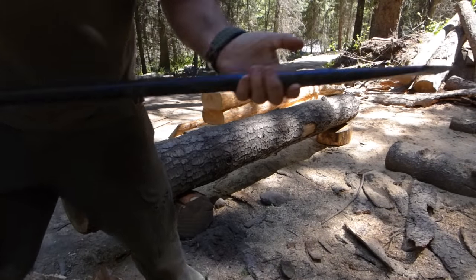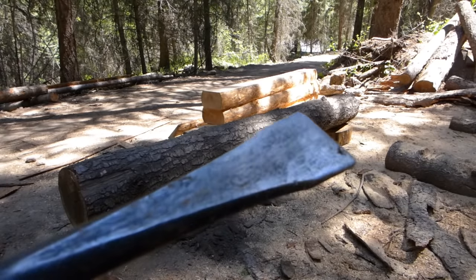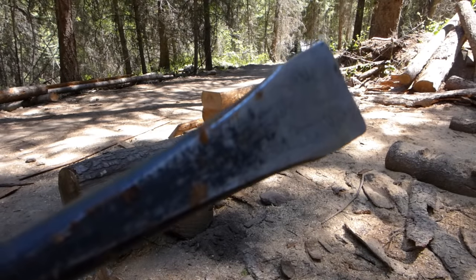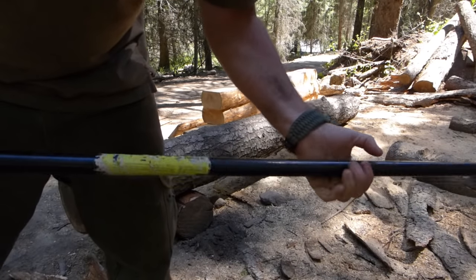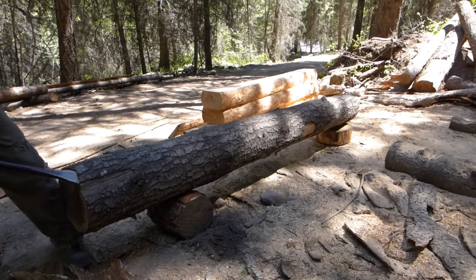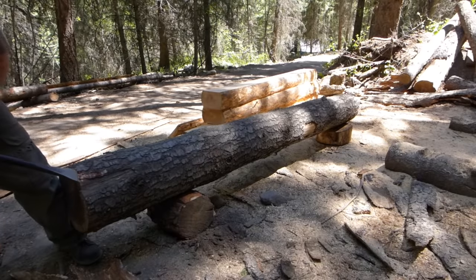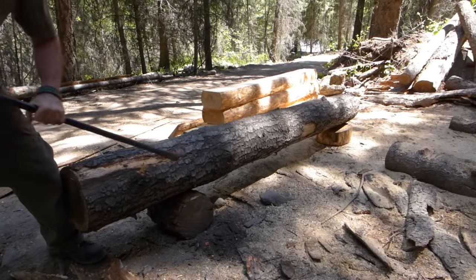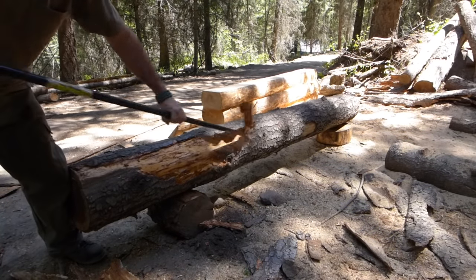So, what I found through trial and error, the best tool that I have available for peeling logs is this Collins axe. It's working for me. I've spent money on other devices, but this has a good amount of weight behind it. So when you start debarking with this, things can move along pretty well. Much faster than a draw knife, that I can assure you. I guess it's very similar to what they would call a spud. It can be a little difficult to get it going. This is pretty much acting as a spud, but this is simply, I found, the best way to debark